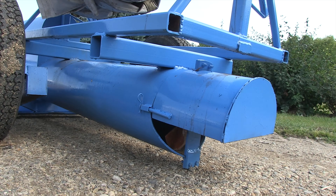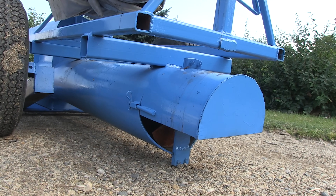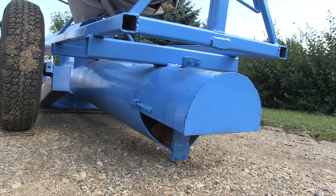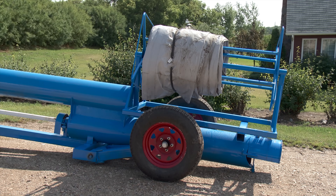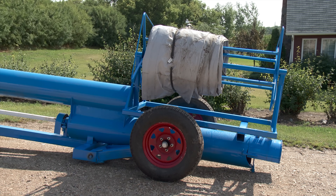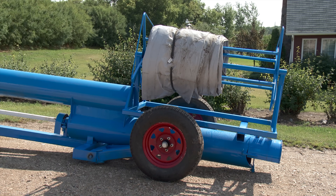Since the pump doesn't need to be primed and can handle mud and other debris, adding the hydraulic feature made it noticeably more effective. It goes through the pump and doesn't plug it up, so we can lower the water table down to three inches. If you go a little bit back and forth with the pump so she really slides into the mud, you would take all the water there is.